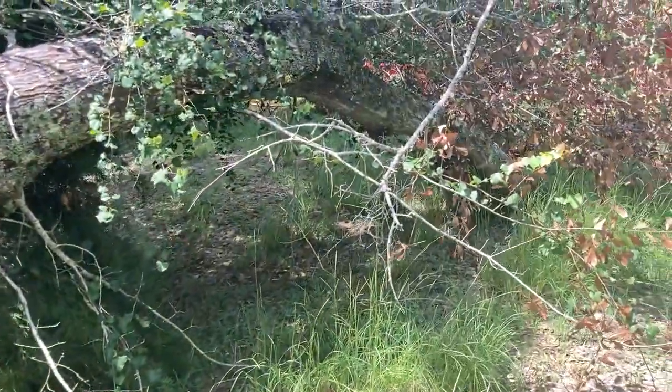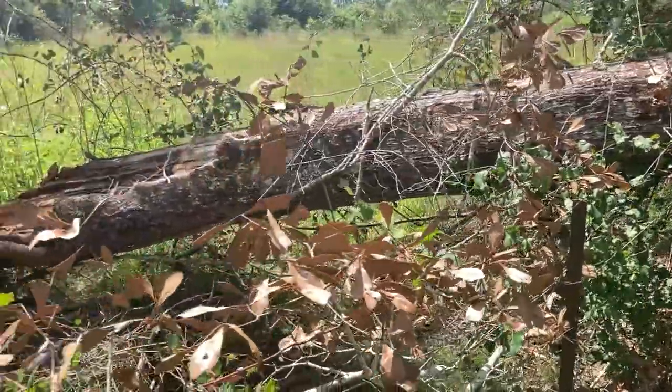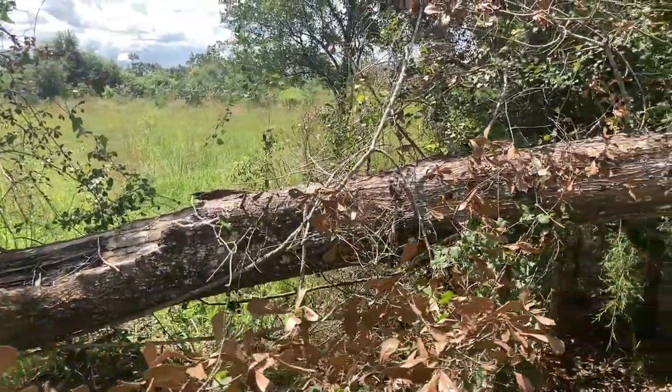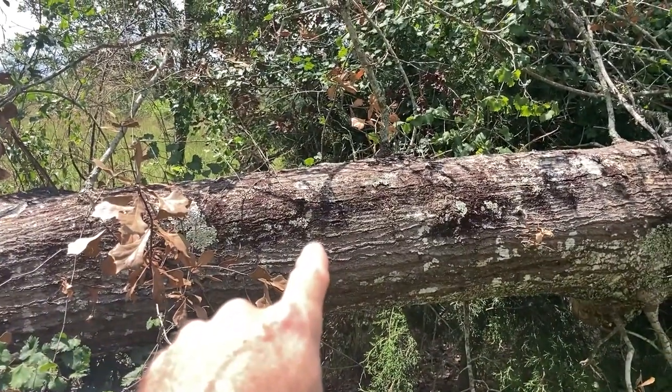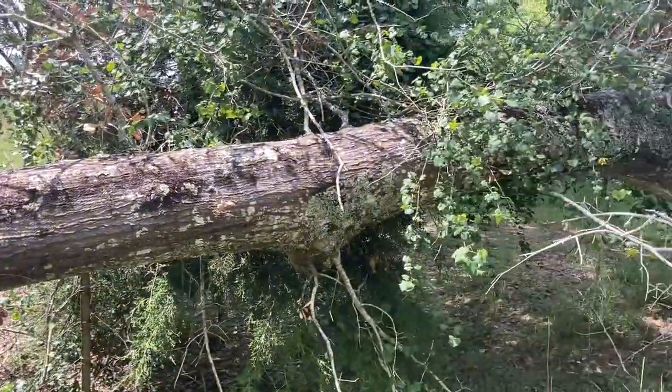I've got both Kubotas out here — the tractor and the mini excavator — to try and get this off the fence without damaging it. But first I have to assess and see what I've got to cut first and where I can pick up with the excavator, because it can't pick up the whole tree. This elbow right here saved the tree from crushing the fence — the fence is barely dented. But this is a good-size oak tree, and you can see it was rotten in the trunk. So I think what I'm going to do is grab it with the excavator right here, make a cut right here, let that part fall down, and deal with the stump, then deal with the rest of the tree in chunks. Our KX-71 is a mini excavator — it can probably only lift a little bit over a thousand pounds.